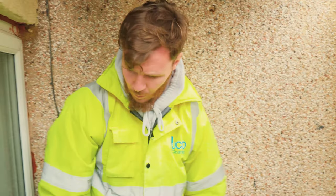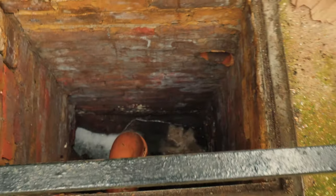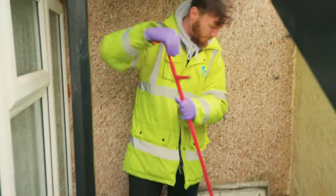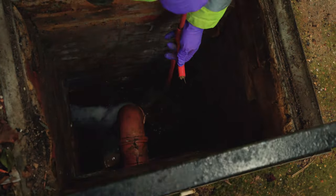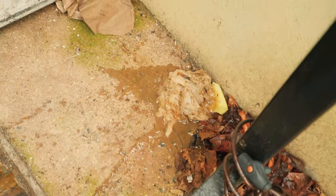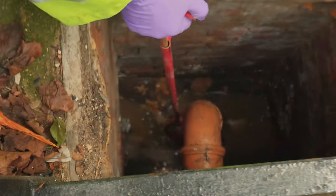Look, that's your blockage. So that's why the toilets are backed up — the drains flow here and there's obviously an obstruction at this manhole. You can see the stuff going around it, the water's escaping around it but very slowly. So we'll get a gully grab out and try to retrieve whatever that is and free up the blockage. It's an interceptor — and baby wipes. Baby wipes under all circumstances do not biodegrade.